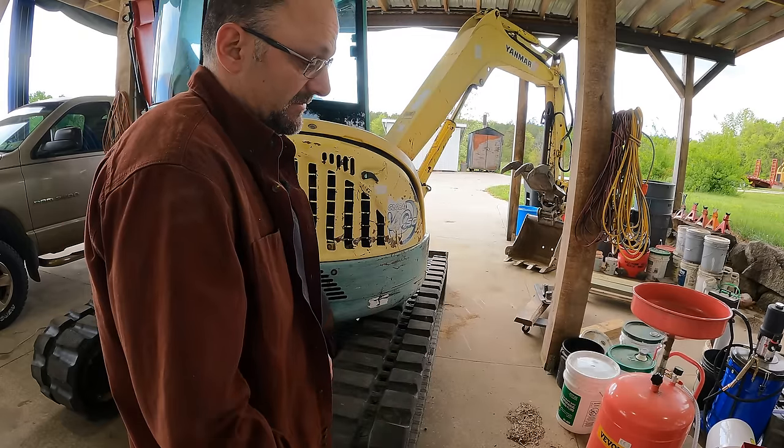And this is a 3/8 British pipe. Well, I've got plugs for that. So in other words, if I drill this out and tap it for this, I can then thread that on and put another test hose right here with a second gauge and have them both at the same time. I think that'll be helpful for testing. You'll really be able to see the two gauges coming down at the same time.